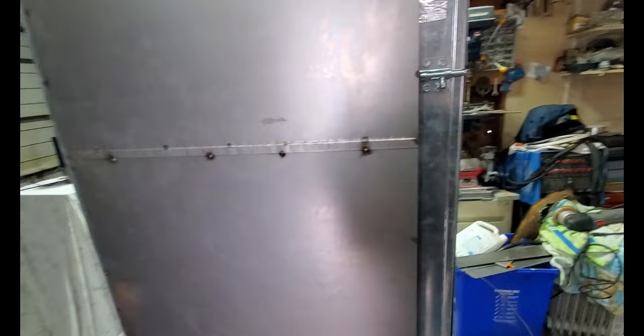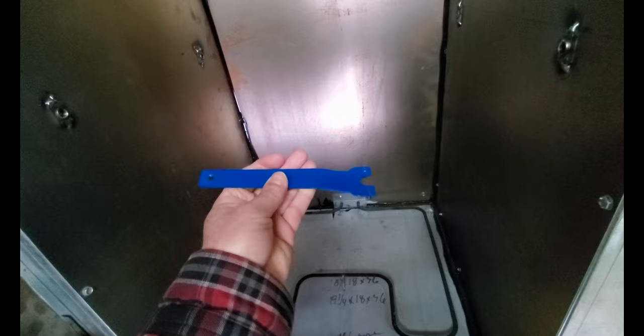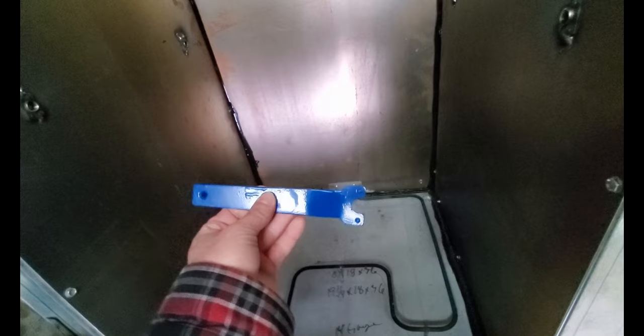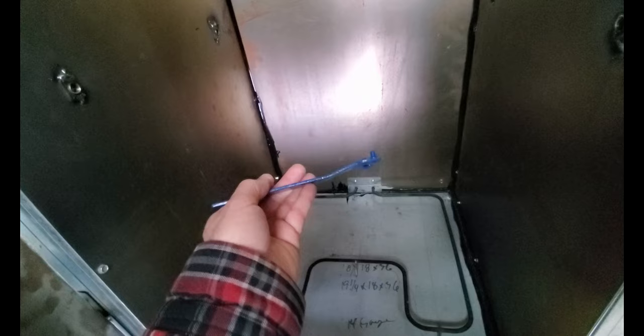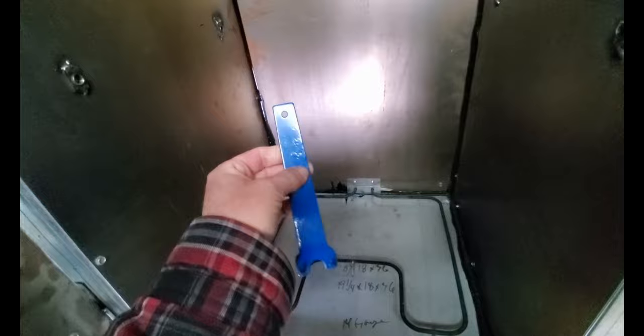Let's finish this video up. I just finished this piece here — it's a key for an angle grinder. I hung it up in the oven, turned it on, brought it to temperature, and this small piece came to temperature at the same time as the oven. All I did was sand it with 80 grit, wipe it with acetone, and spray a coat of powder on it. As you can see it's a bit uneven — there's definitely a learning curve. I hung it back up, turned the oven back on, and baked it for 10 minutes after it came to temperature. I think it turned out pretty good for a first time — the oven definitely seems to work. Thanks for watching guys — looking forward to some more powder coating videos in the future.